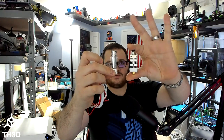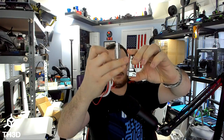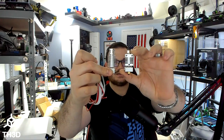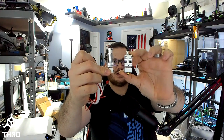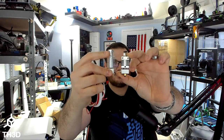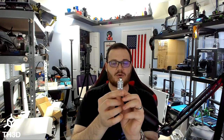Here's a hotend from a CR-10 style — an aftermarket all-metal one. Compared side-by-side, this one has much less surface area. When you put a Noctua on this style hotend, which has a very small heatsink and limited fins, you're going to get what's called heat creep. The job of this heatsink is to keep the upper portion cooled, because that's where your PTFE comes down into. On an all-metal hotend, the PTFE stops partway; it doesn't go into your melt zone.